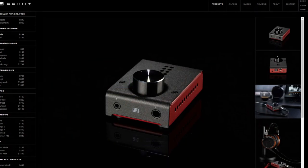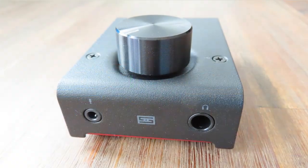The listening sessions were average, maybe average-plus — kind of meh. A product at this price should sound a lot better. The RightMark results were also average for a product of this price, and I checked and rechecked to make sure. The channel balance being off is a real miss — for a quality product the volumes should be exactly the same. It did improve after a day of use, but out of the box it was almost one decibel off, which is audible. So I'm not going to recommend the Fuller E — there are just too many negatives to justify the price.